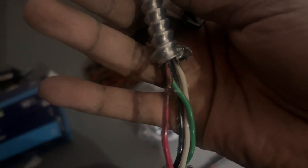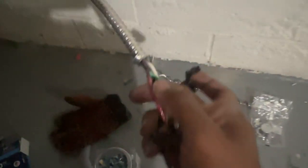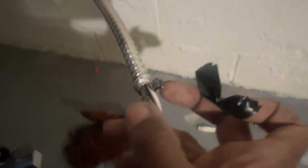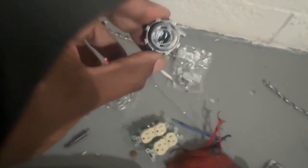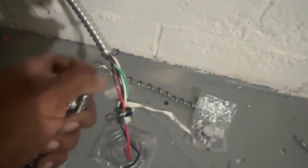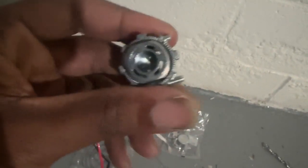Just turned this power on. What happened was I just wired that red wire right there, but it was bare — it got cut or shaved back somehow. I'm wrapping some electrical tape around it to make sure that's good. You definitely got to watch when you're putting these connectors in here — watch these sharp ends, make sure they're going in fine. I wouldn't even recommend these connectors here if you're using three hot wires — technically four wires total. If you're using three hot wires, I recommend not going with this one.